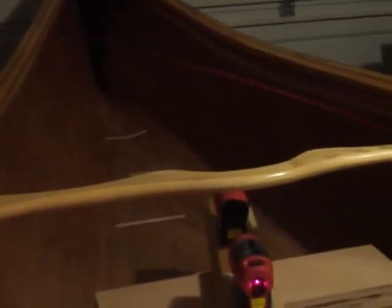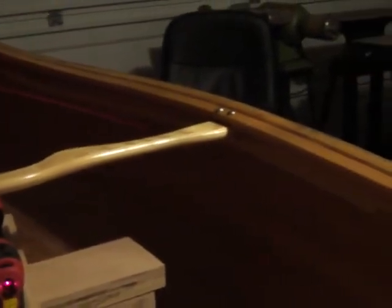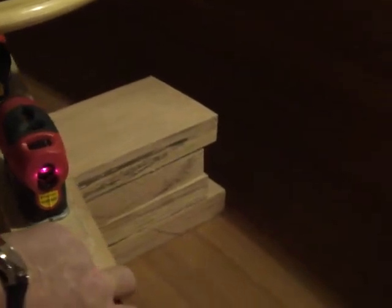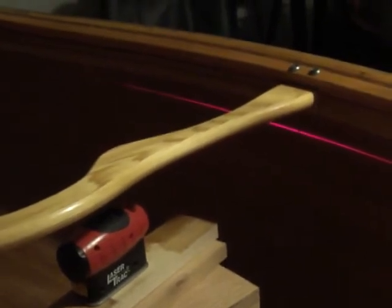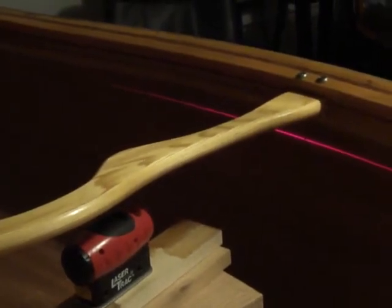When I first turned the laser level on, I went and measured from that yoke that's in the center — the laser levels are just below it. I went and measured down to the laser line. But if I rotate this, as I rotate it you'll see that line come around. See the line coming around? You see the hash marks in there? I measured below the yoke to the red line on both sides and I'm within a sixteenth of an inch, maybe an eighth of an inch at most.